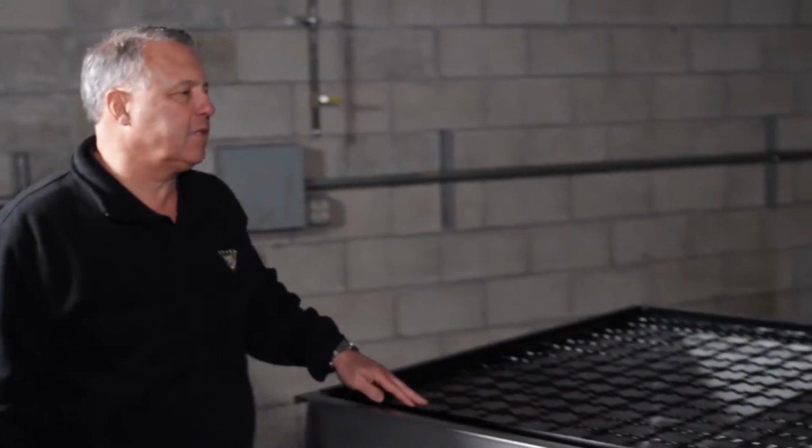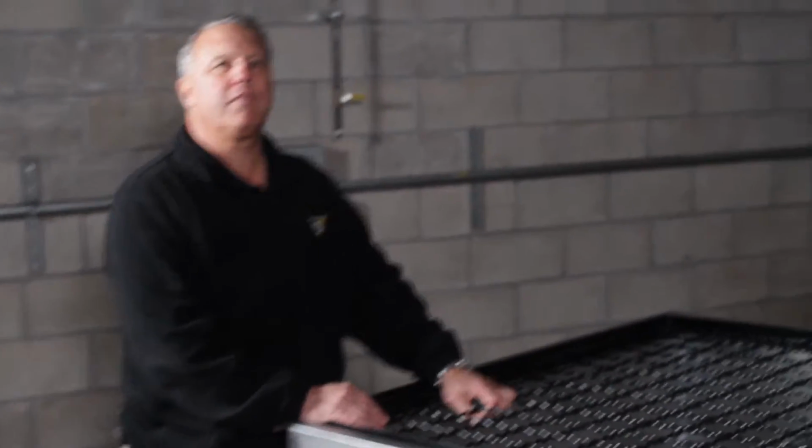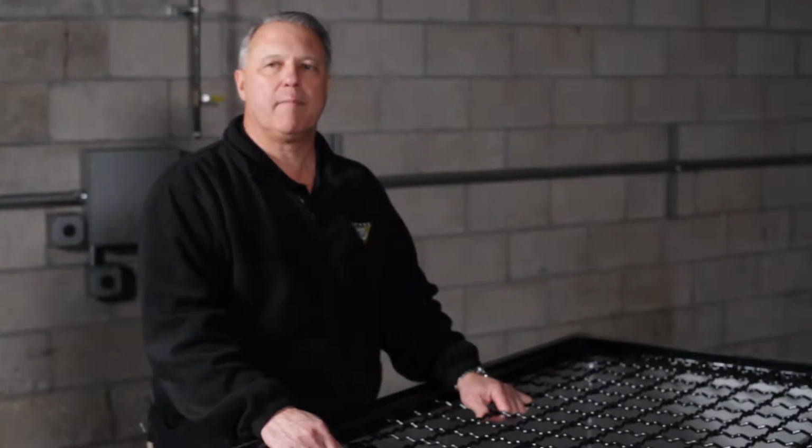Our units are different in the fact that we use a woven mesh rather than a welded wire mesh. Across the top of the hopper, we weld in a balanced lifting eye, doubling as 2 supports. An option inverted V is mounted on the inside of the hopper to help prevent the bridging of the sand, and it actually takes the sand and pushes it to the outside wall of the spreader.